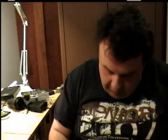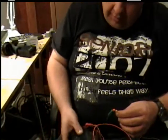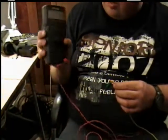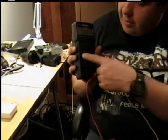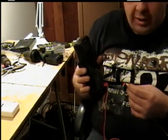You can test them with a meter too. You do that by putting the meter in the diode symbol — with the little arrow there, the little plus-like sign in front of it, right there. And they only conduct one way.